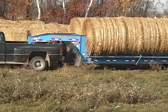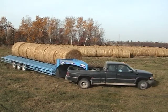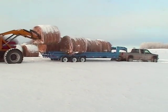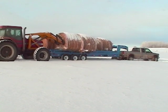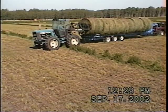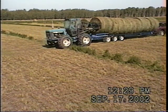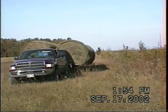Each side can be unloaded individually so that the bales store in a smaller area. The trailer is stable with only one row of bales on board, and getting them positioned right is easy. Loading bales is a breeze — end loading means you don't have to use a grapple that can compress your twines and rough up the bales. All you need is a single or double spike. Side loading is also possible if that's what you prefer. When the bales are end loaded and pushed tight together, they roll off as a group. This protects the ends from the weather so there's less spoilage in the feed yard. Your livestock will love the higher quality feed and you'll use less of it.